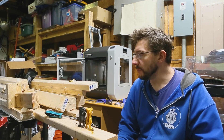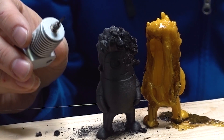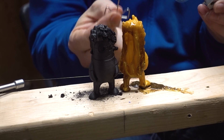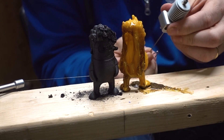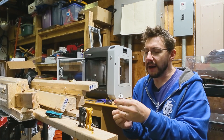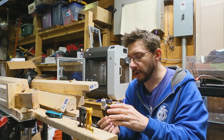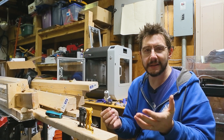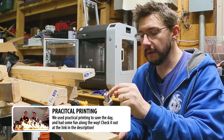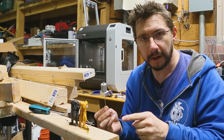The reason this is important is because when you have something like this jammed in your heat break, in order to pull it out you're gonna have to use a lot of heat. And thankfully we have a lot of heat. What I want to do is set this up so that I have a little push rod right here. That push rod I will push up from below as I'm applying some flame to the heat break, and it should push the plug out. I know I could use a heat gun, but I don't know if it would get hot enough. I've seen videos from Vision Miner where they've used flame to get things out. So what I'm gonna do is use flame to heat right here, then put some pressure from down below, and hopefully it'll pop out that CF-PEEK plug.